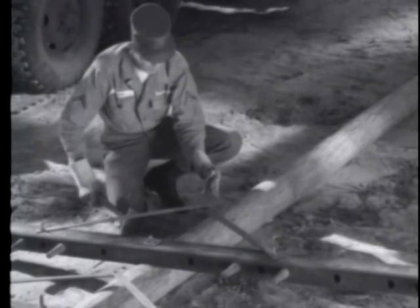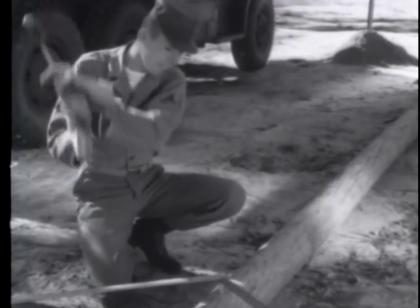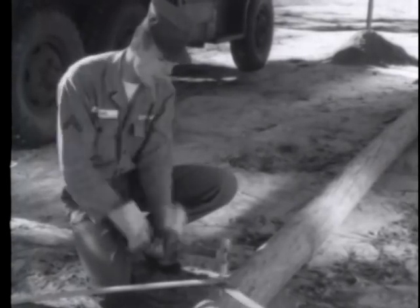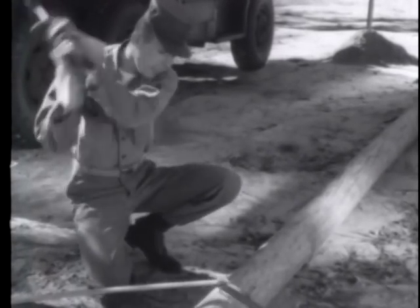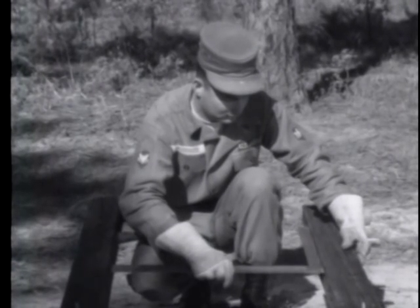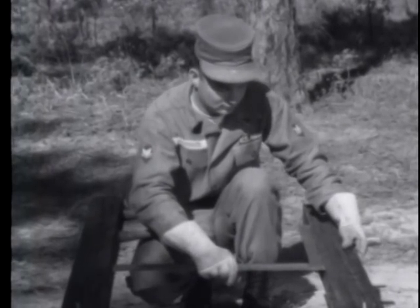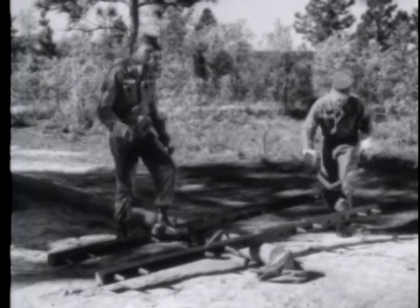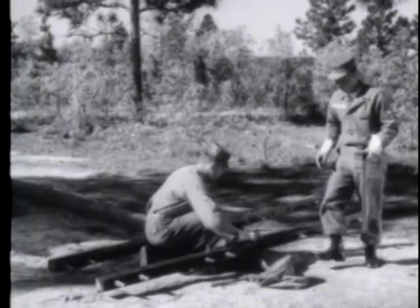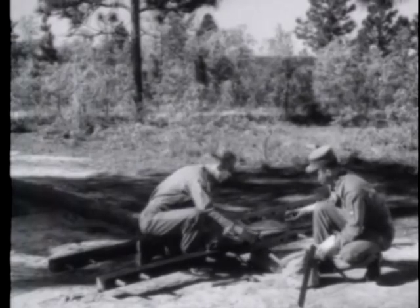The lower ends of the cross arm braces have been brought together so that the holes overlap. A 4.5 inch lag screw is used to fix the braces to the pole. Once the lower cross arm is in position, the other cross arm is lined up parallel to the first using the square. After lineup, you tighten the nut of the through bolt for the top cross arm and fix its braces to the pole in a similar manner.